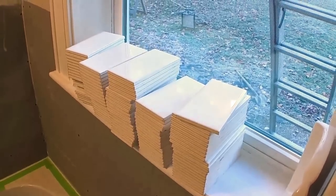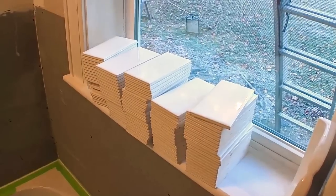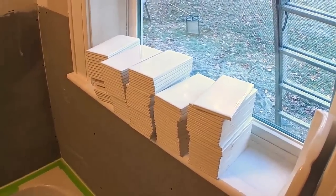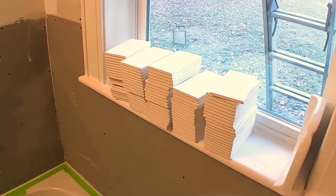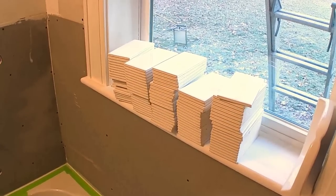The tiles I'm going to be using are three by six — people call them subway tiles. It's a good traditional look that I want to stay with in this house. I'll be doing a running bond, which is like a brick bond — you'll see they half overlap the joints.